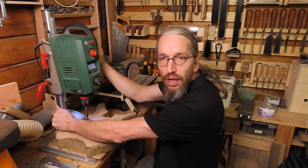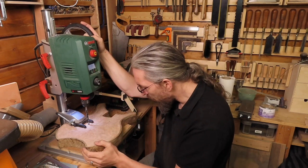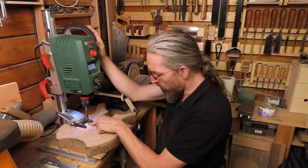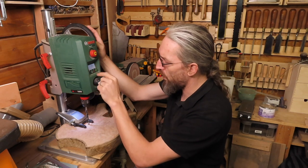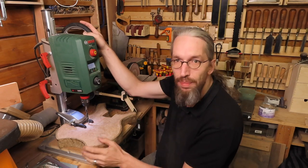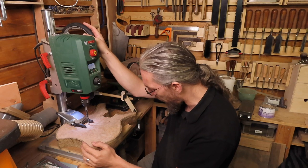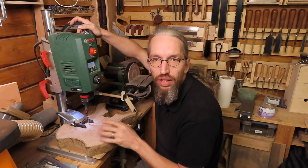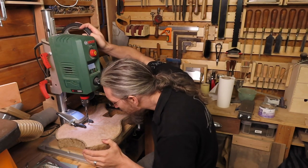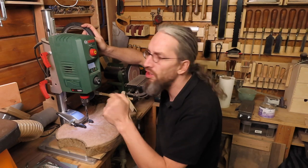This should be good. Then I tighten the clamp and set the depth on my drill press. I'm very lucky — my drill press has a digital gauge, so with the drill bit resting on the body I can zero it out and use the gauge to determine the required depth. Make sure you're absolutely dead center, so before drilling I check and double check again. This looks absolutely fine — fingers crossed, I start drilling.